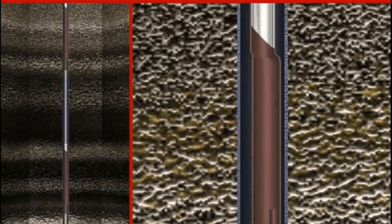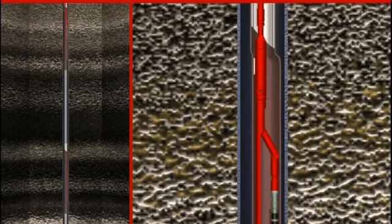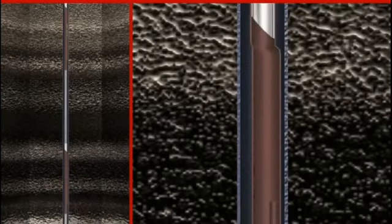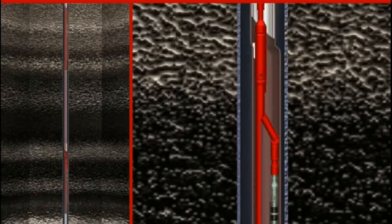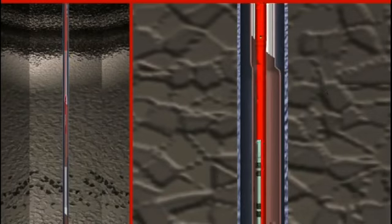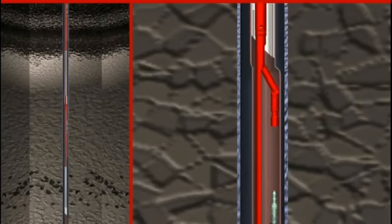After all dummy valves have been retrieved, the wireline operator will remove the pulling tool from the bottom of the KOT kickover tool and simply attach a running tool. In running gas lift valves, the reverse order to the pulling procedure is implemented. The operator begins with the top mandrel and installs each gas lift valve in sequence. The operator continues slowly through the mandrel, stops, and then starts uphole, kicking over the KOT tool, then jarring down until the gas lift valve is securely in the pocket and latched into place. This shears a pin and leaves the valve in the pocket. The operator then proceeds back up the hole to repeat the process for each of the mandrels.